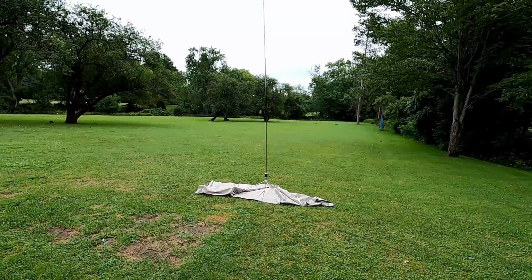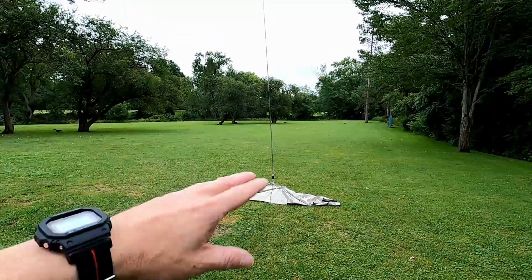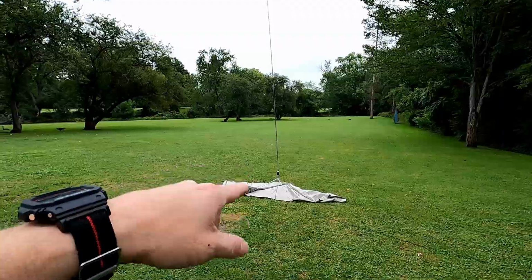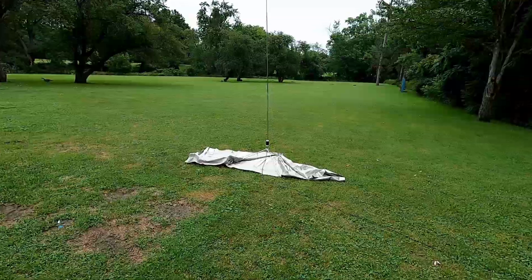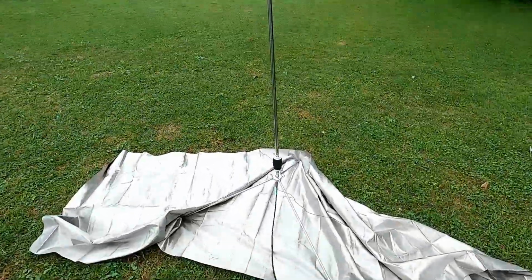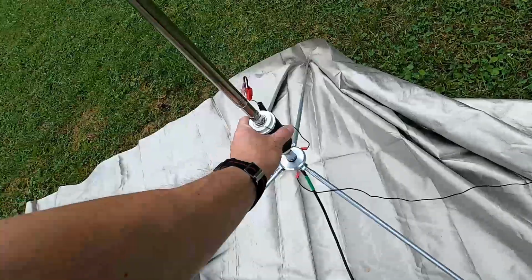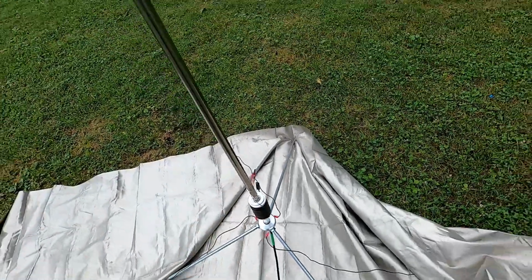I do have the bigger coil that you can adjust and everything too, but that Sporty 40, once you get it dialed in, that thing works great, and you can run 100 watts through. I don't want to run 100 watts CW through that Silver Bullet. 50 watts I'd probably be okay with. Anything more than that I wouldn't be too fond of, because they'll get hot and they'll melt. But this guy is warm, just barely warm to the touch.